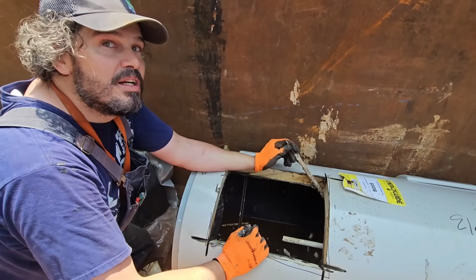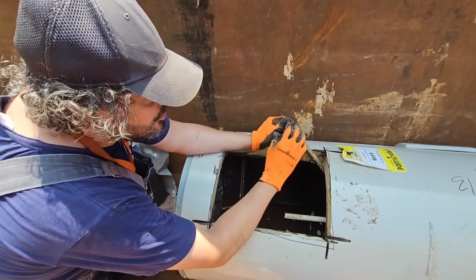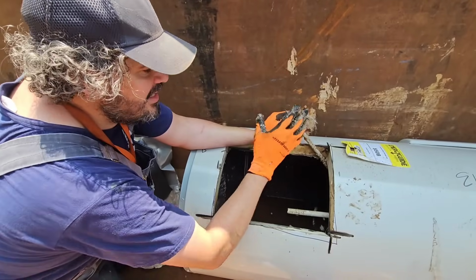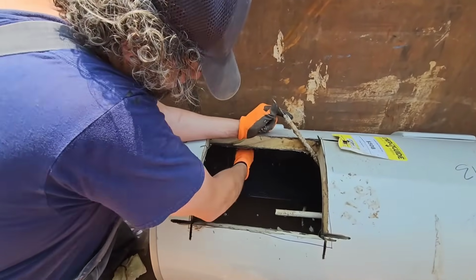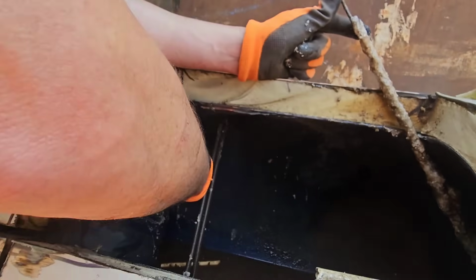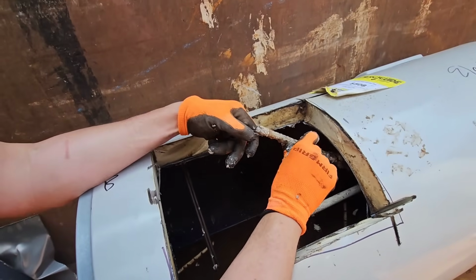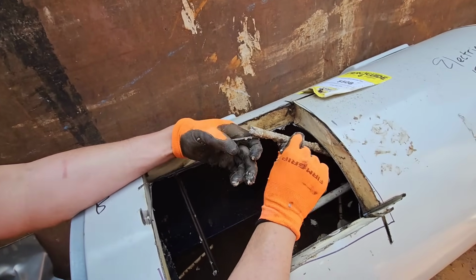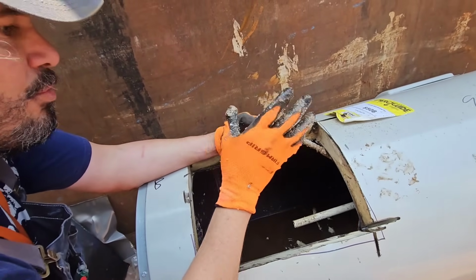Really interesting. Wow. But this is a sacrificial rod. It's creating its own electrolysis. So it's creating something for the water to go do instead of attack the connections of the tank, like where the elements connect or the drain valve connects. Right. It's giving the nature of water something to do because water, by nature, wants to connect and attach to something. There's ions in the water, electrons that want to go do something.